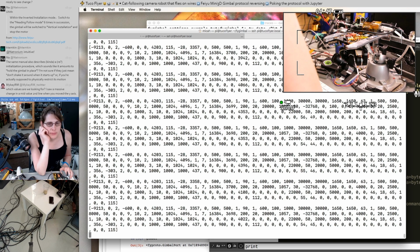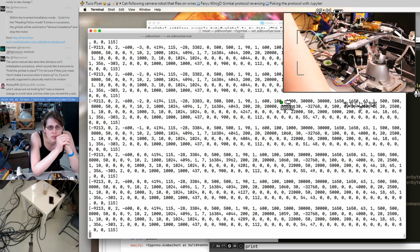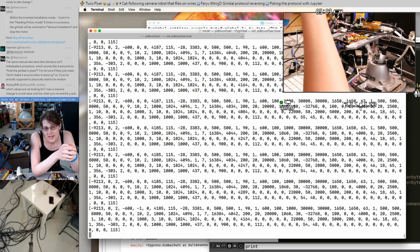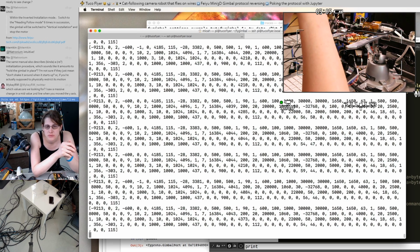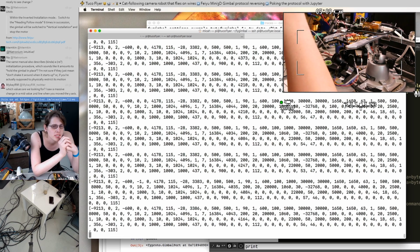I can imagine them implementing this a bunch of different ways. This might just be a blob of SRAM that they use for some settings and some runtime values, and then they just save it to flash anyway. I can imagine them having different formats for in-memory, like RAM and flash. I can imagine that this isn't actually in RAM at all, but this is just like a command layout, and they've got a switch statement that generates the values as needed.